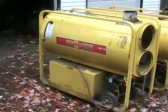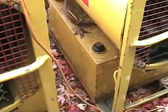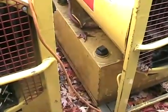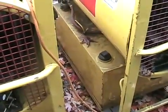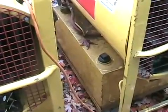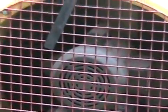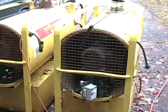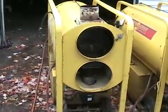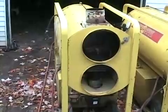These work just about the same as your oil furnace in your home, at least if you have a modern oil furnace. They work by burning kerosene, heating oil or diesel. Diesel is an awful smelly — you wouldn't really want that in your house. The other oils aren't too bad. They've got a combustion chamber in that big tube, a heat exchanger, and a powerful fan motor to blow air through there. Something like the way your furnace works — pretty much exactly the same, just a different shape. Hot air blows out that end so you can heat up a shop, an apartment building, something you're working on, a building, or a giant tent.